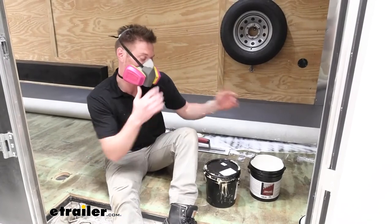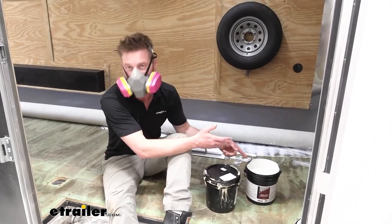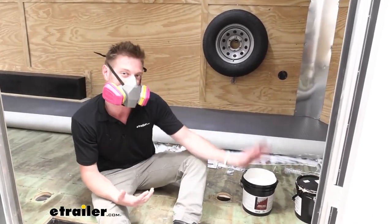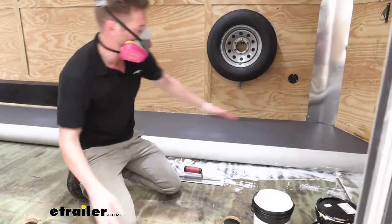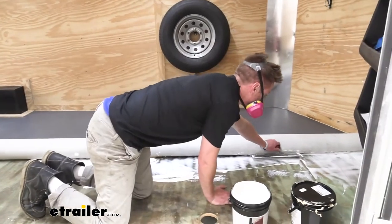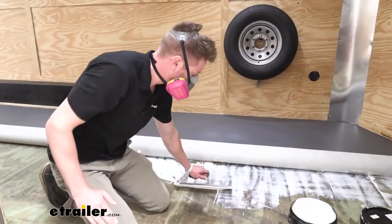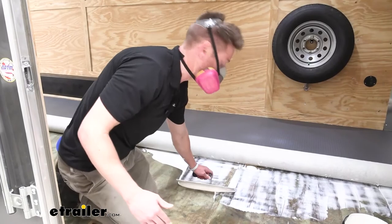Right off the bat, the difference between the two glues is obvious — the 601 is a different color, and the 801 is white. But the 801 is a lot thinner so it's a lot easier to spread; I really like that and it's not giving me nearly as much trouble as the 601 wood glue. One little tip: once you have everything up against the crack, stick it in and then just start pulling it away — that section is good and you can just continue covering more ground.